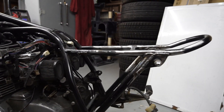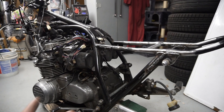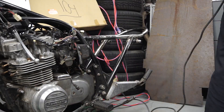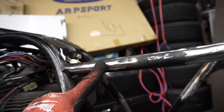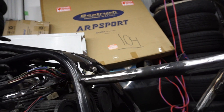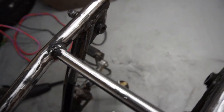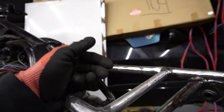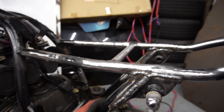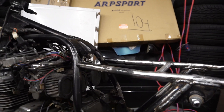I'm going to cut these last two tabs off and clean them up, and that'll be it for the frame modification. I think it went pretty well — next we'll be doing the battery box. I don't like these grind marks; they have flat spots, so I'm going to sand these down with some 120 grit emery cloth to smooth it out. On the center bar you can see some flat spots, but nothing like how it used to look — compared to what it was, it's a million times better.